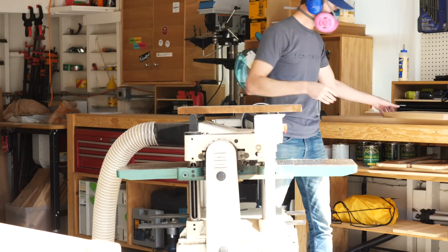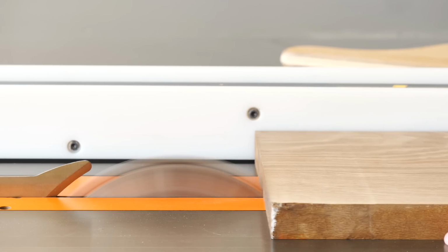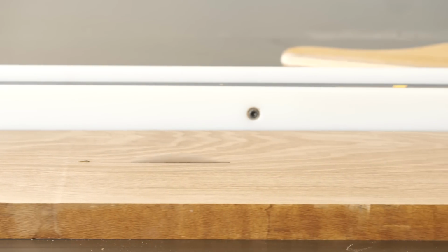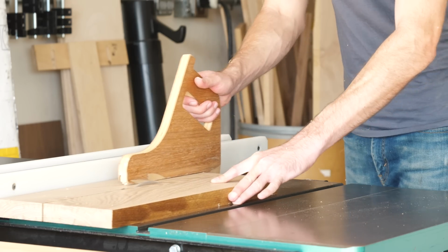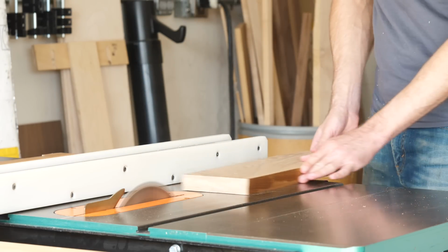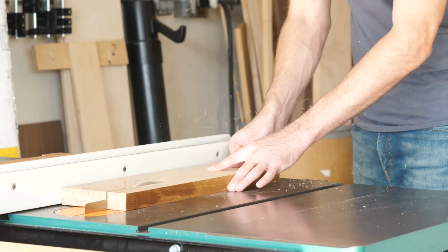In total I'm going to need 3 legs, each of which is comprised of 2 pieces. We'll call them the upper leg and the lower leg. So with everything milled, I headed over to the table saw to prep all of my pieces for getting cut to shape, which will eventually happen using a tapering jig. I started by ripping them to width and then cutting a 15-degree miter on both ends.